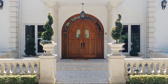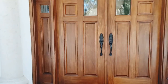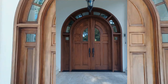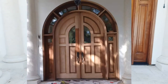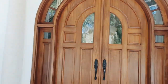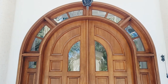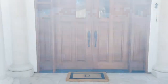This front door was the main reason he wanted me to come out here. It hadn't been touched since the house was built 13 years ago. I ended up stripping it down to bare wood. We were having a real tough time matching the stain he wanted. I finally found one he really liked, did one door, and he gave me a fist bump. Then he came home that night and said it dried way too dark. So I had to sand everything down again to bare wood — it took four and a half days. We ended up using the stain he'd said was too dark, but I cut it down with mineral spirits. I used a conditioner on the door, then applied the wiping stain in small sections and wiped it off. Then I used Wood Coat UV 450, a matte finish oil-based sealer, and did three coats. Good stuff.